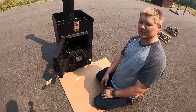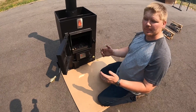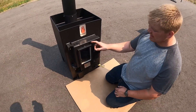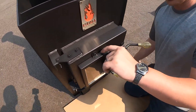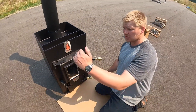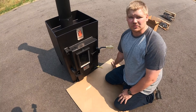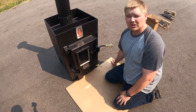When you have a glass window — and the glass window is optional — there's going to be a little gap at the top. That gap acts as an air wash system: air enters in and creates an airflow around the glass that keeps the glass clean while the fire is going, so you don't get a bunch of soot and ash building up on your glass window.